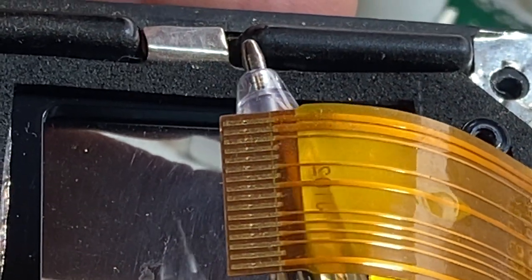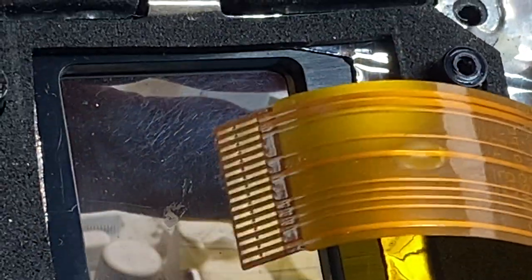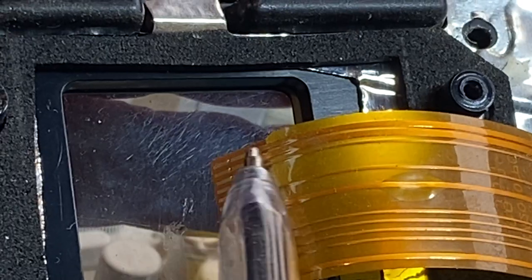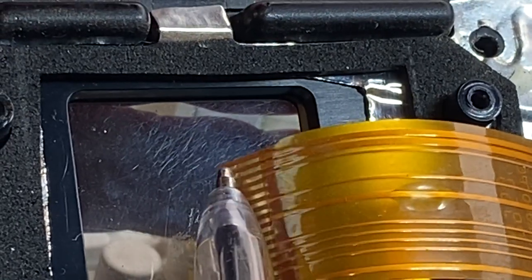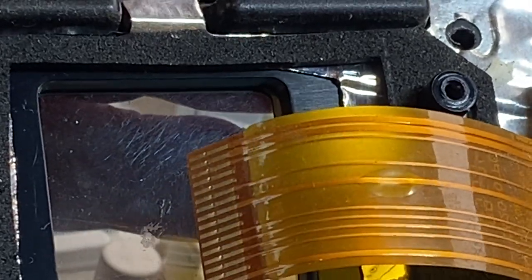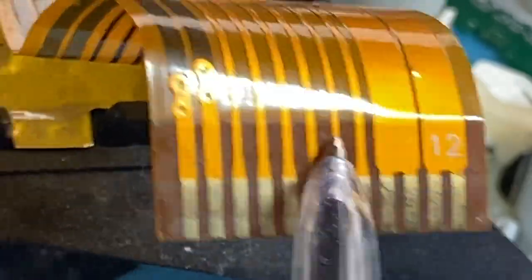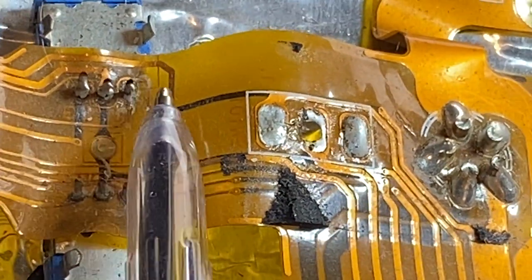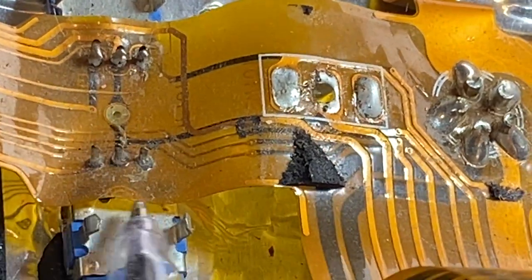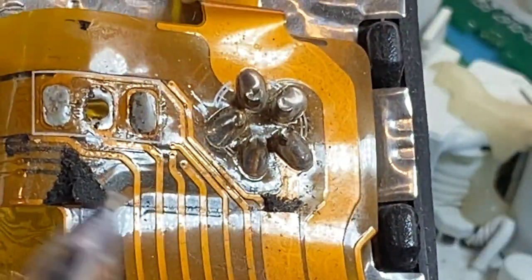And you know, if you've got a problem like you want to track these out with your multimeter in continuity mode, it's very difficult to keep a tip on something that small, but it can be done. You know, I've done it. You put it on, they go through, end up here, or they end up on the connectors here. Track it through. You can see where they go, and just wiggle it and bend it.